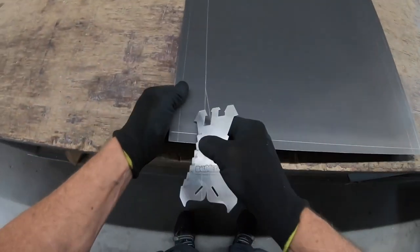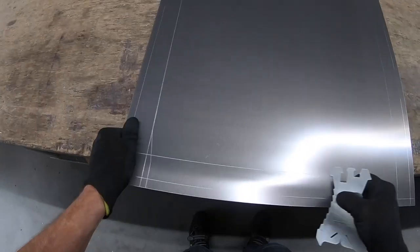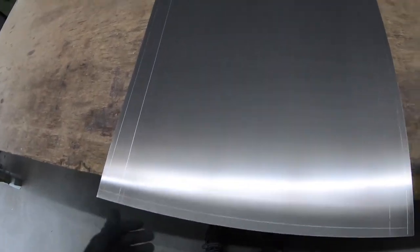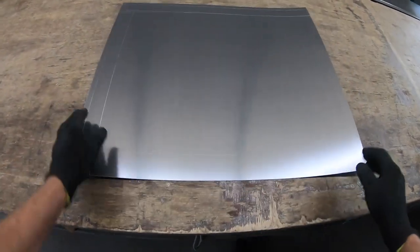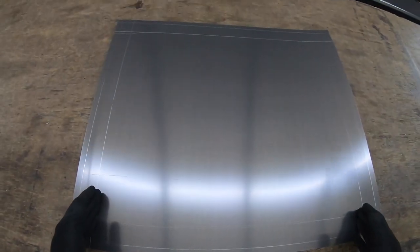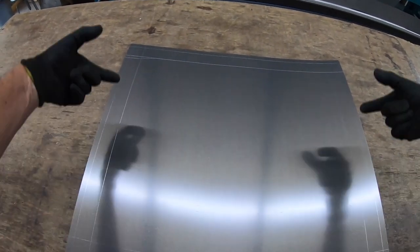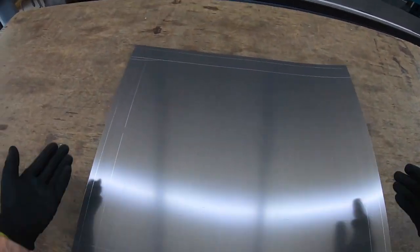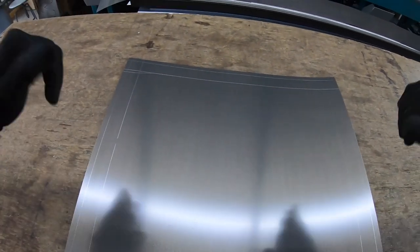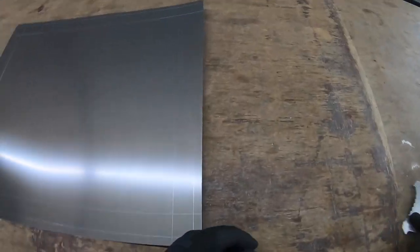Of course, it is important that all four sides are folded at an angle. So from the cut you have to calculate that the cut is actually my lid dimension, which I would like to have finished, plus the upstand, the material how high the cover should be afterwards, plus 1.5 in my case as an envelope to the inside, so that there are no sharp edges.